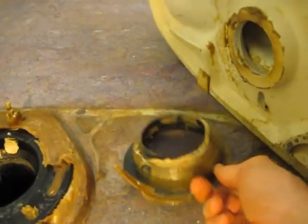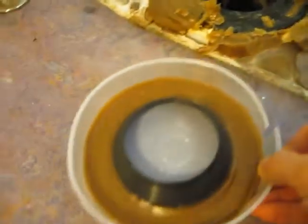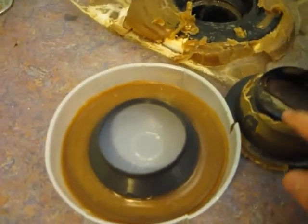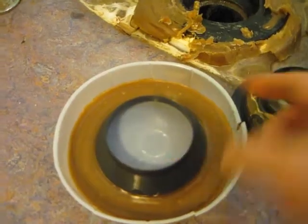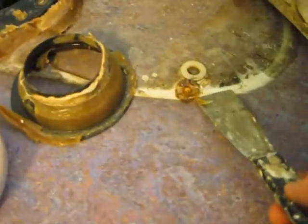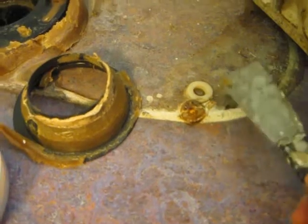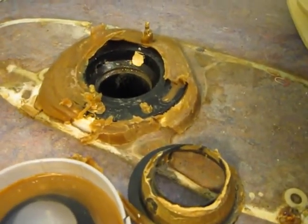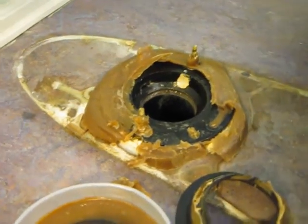This you don't keep. You know why? Because if you look at your new wax ring, this plastic part here is this plastic part here. So it just got kind of glued on to the bottom of your bowl. And a couple other things you see. I see some shims here. Actually, somebody used some metal washers here for shims because the floor may not be level, and so we'll probably have to deal with some shimming. We'll use some wood shims.